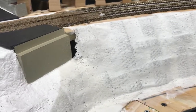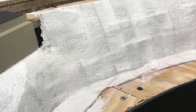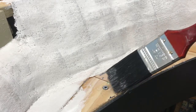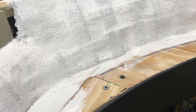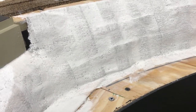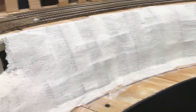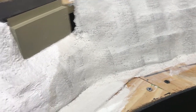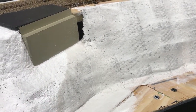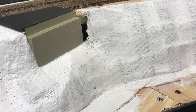Let's address this little gap right there and the riverbank as well. You can see I've got a seam right here, and that would be a big problem when you put any sort of resin in there — it will seep out if you have as much as a pinhole anywhere; it will find its way out. So we definitely want to cover that up with something to give it a leak-proof bed to pour our resin. Let me mix up a little batch of Sculpt-A-Mold and we'll tackle this area.